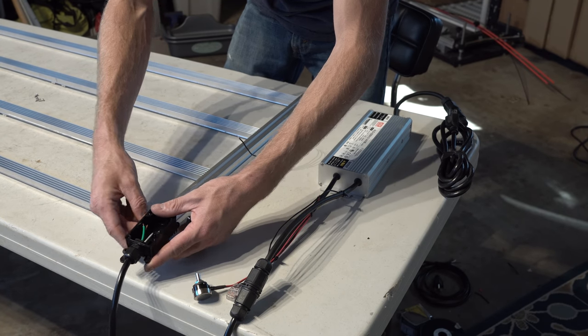If we're all good and she fires up, make sure she goes all the way to full power. Should have about 330 watts at the wall, plus or minus a few. And make sure she dims all the way to off. We're there. Fantastic. Congratulations, guys. You essentially at this point have a fully functioning, working, amazing light. And proud of you guys for building it.